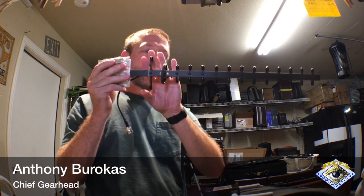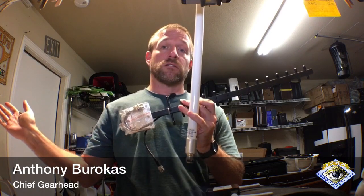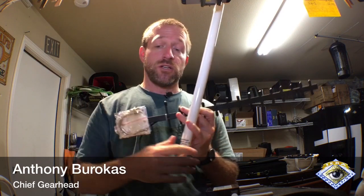This is a 2.4 gig antenna, but you can find versions of this that are 2.4 and 5 GHz. What they do is send all of your signal in a certain direction, and that makes a big difference, because if there's nothing behind you, there's no reason to send that signal vertically behind you — you're throwing half of your signal away. Half of the power of your radiated signal is going in a direction that nothing is going to use, whereas if you can send it all in one direction, that's much more efficient.